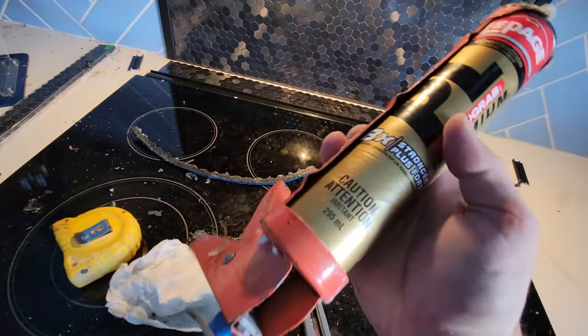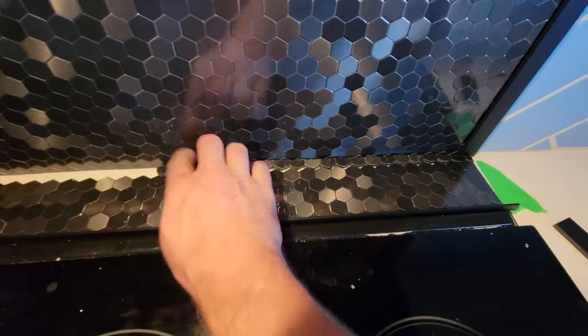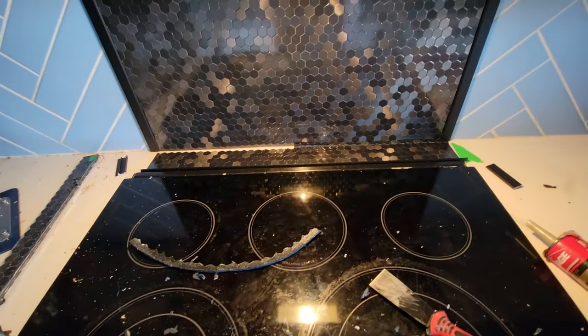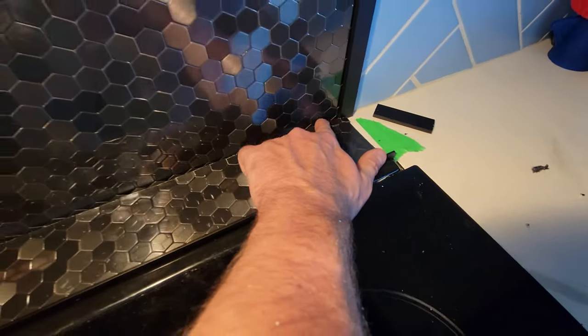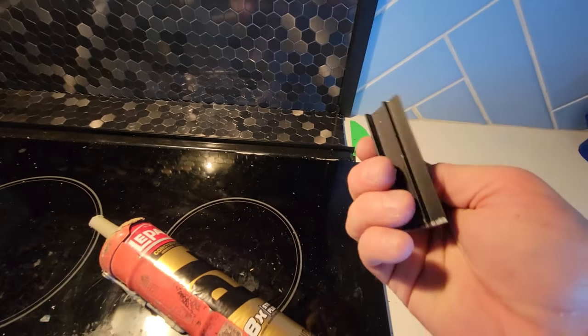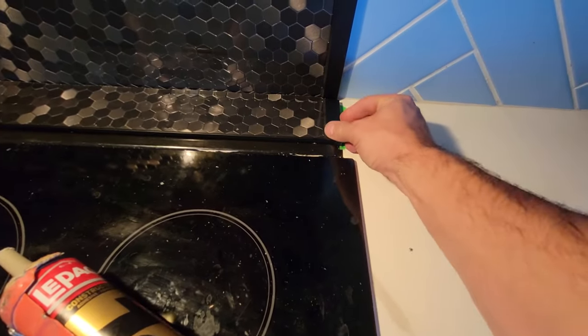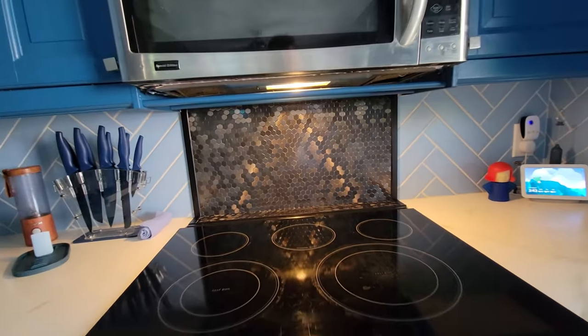We're going to use PL8 XFAST grab to glue this to the counter as well as the pieces on the side. We cut this little sliver here — that's a dry fit — and we have the other piece right over here, so let's glue it all and clean up. The aluminum trim is already glued in, and we cut in and placed that piece — it fit perfectly. We'll put black silicone right here to get that seam nice and sharp. The edges are already pre-cut, just glue them on both sides, and here we are — finished product. It looks absolutely beautiful, a very easy way to upgrade your space and create almost like a feature wall in your kitchen.